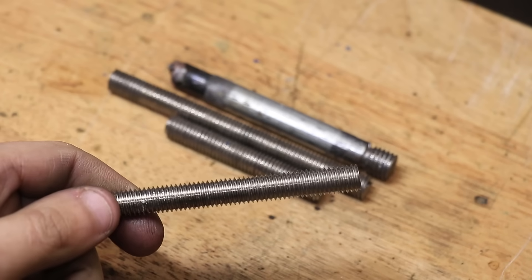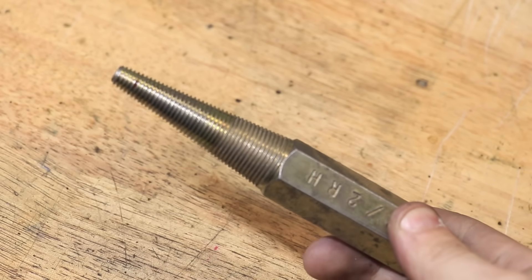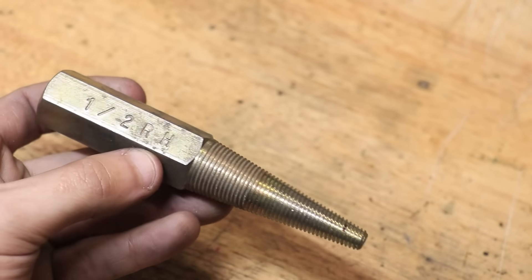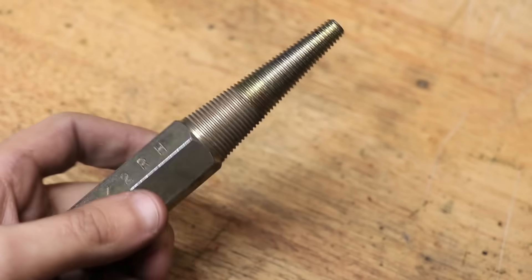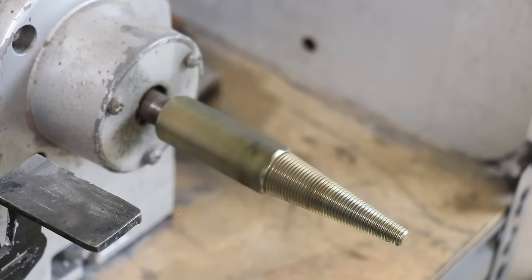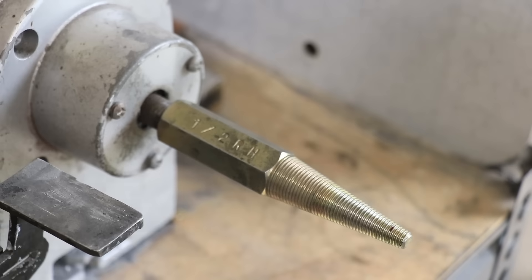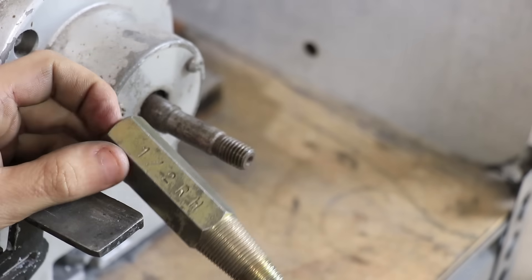But this week I want to take it to the next level and machine some tapered threads. This is one of those tapered mandrels that you would fit on a bench grinder — tapped at one end, and at the other end there's an external tapered thread onto which you'd fit a buffing wheel. I want to remake this one because the mandrel uses a half inch thread, whilst the bench grinder I have is made for M12. I had a metric one but since moving into the new workshop I haven't been able to find it, so after two or three years it's time to make a replacement from scratch.